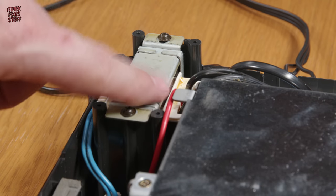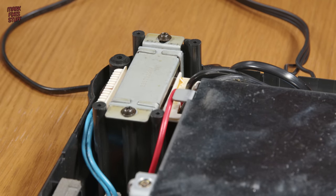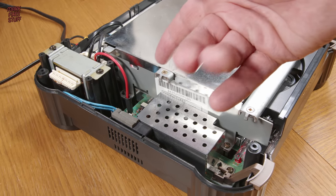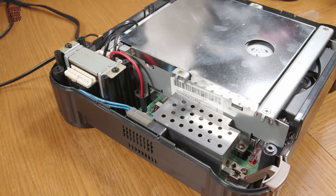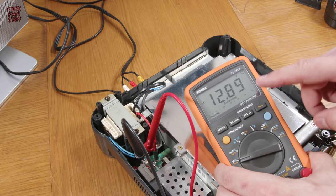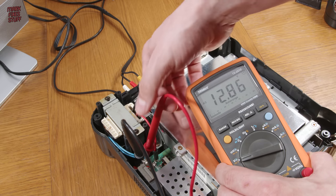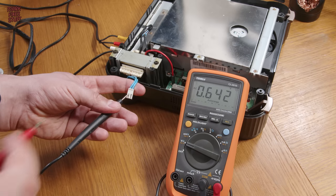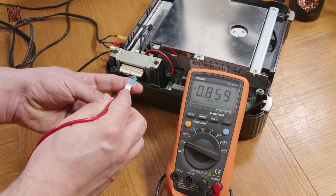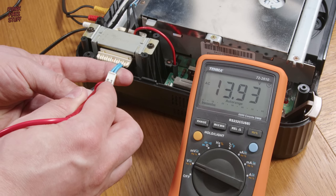But let's see if we can do away with the need for a step-down transformer. The voltages in a 3DO are quite forgiving — anywhere between 13 to 20 volts AC will usually work. The AC voltage to the board is a very low 12 volts AC, probably due to the step-down transformer and inefficiencies. Removed from the load, the output measures just under 14 volts AC, which could again be due to the cheapo step-down.